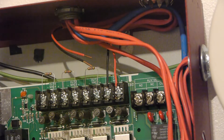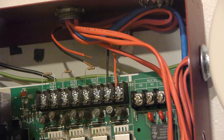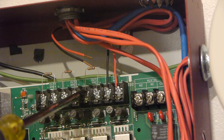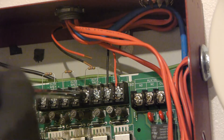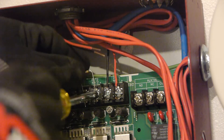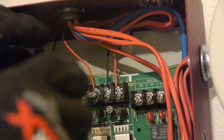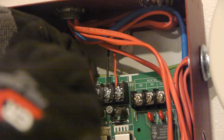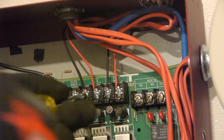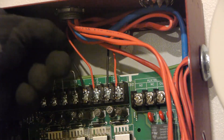Now we're back in the mechanical room. I'm going to go ahead and open up the remote power supply here — here are the wires. Since there's already a resistor on the other end, we have to go ahead and pull out this resistor. Now the system is in trouble. The silver part on the left side of these terminals is normally where your wires go. If you only have one set of wires going through the terminals, it normally goes on the right. Now even once we connect these, the NAC panel is not going to go back to normal because our device is still missing.